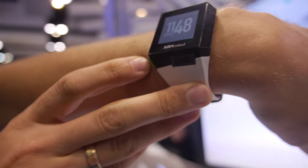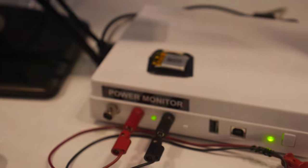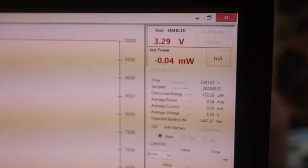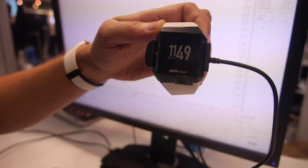Let's look at the battery module. What we're showing here is the power consumption of Embed OS. The watch uses around 70 to 80 microamps. And that's with the actual animations — every minute you do the animation of changing the minute, which uses quite a bit of power. Even with Bluetooth on, the watch is still using around 70 to 80 microamps.